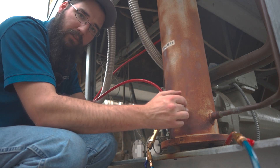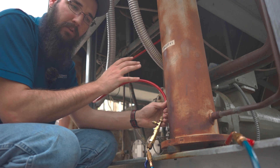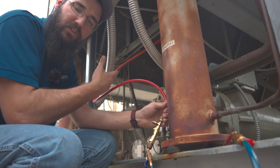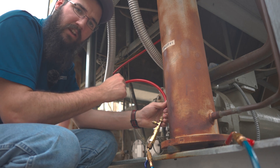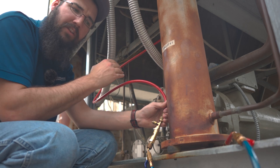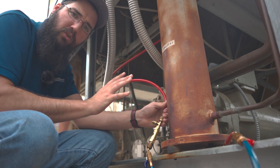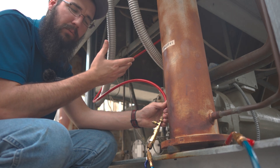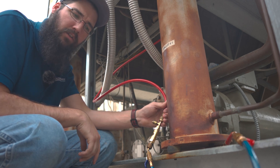It is very likely that the low oil level is affecting the slide's ability to move. If we can't control the oil on the slide properly, we're not going to load and unload the compressor properly, and that's going to lead to issues with the suction saturation temperature dropping out. My theory is that because this compressor at startup is only getting down to about 60% of total capacity — typically these start off in the 40–50% range — the low oil level is not allowing the compressor to unload the way it was intended to. That leads to it being overstaged at startup, pulling refrigerant at too high a rate, running the barrel too dry, and eventually tripping out on low suction saturation.